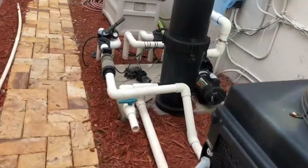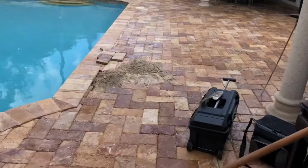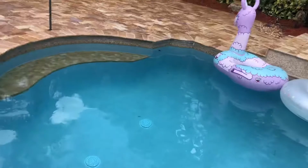So nevertheless, we're back here at the job site, setting everything up. I've already done the pressure test, as I said. Let's go check it out. Come in here. As you can see, I got my rig all hooked up, pool return pressurized, not holding any pressure. We already backed down all of the pressure in the pool. I'm gonna be setting up my tent because it's massively hot. This is where we found the culprit, right here, this pool return. So we got them all plugged up with our 1.5-inch test plugs. Now, let me finish setting this baby up.